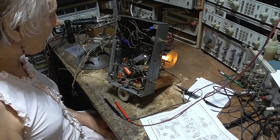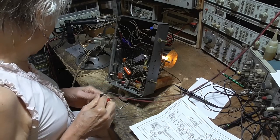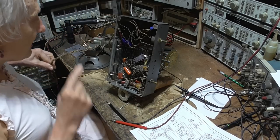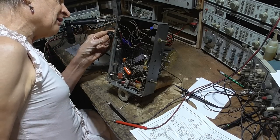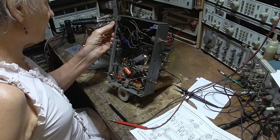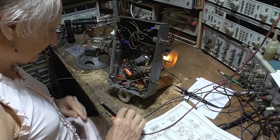Juice it up. We're going to look between the cathode and the first grid and see what the bias is on that power tube. Oops, that ain't gonna do. Now watch out. You've had the power on. That capacitor is full of voltage. Okay. Keep your finger off. Keep your finger off, unless it goes like that. Okay, it's good. Okay. Now, go get it.